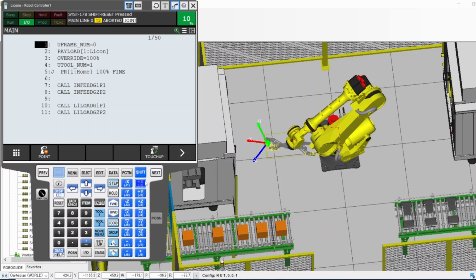I should say number when I am jogging by joint, because it depends on the joint number. No more X, Y, Z. There is no space anymore. Now I'm moving each joint by itself. I'm not using the space around the robot for my movement. But if I use world or tool or base or user, then I'm talking about a point in the space around the robot.